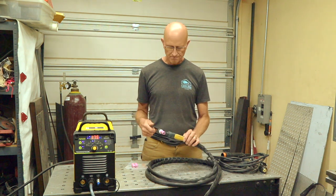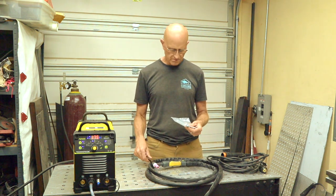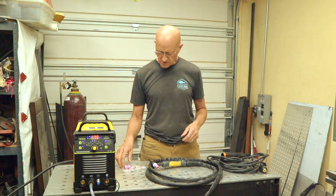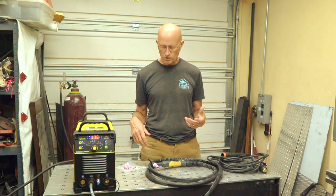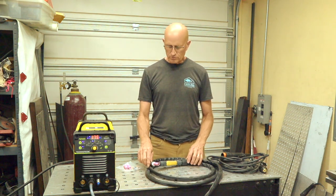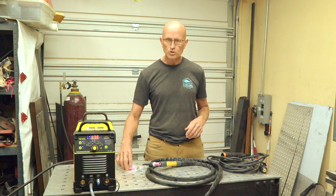It's perfect for 200 amps or less. It comes with a long handle, a short handle for tightening your tungsten, three or four collets, and three ceramic nozzles — basically enough to get you going. If you're going to do a lot of TIG welding I'd suggest buying more, and if you're welding aluminum, gas lens kits are kind of the standard now and definitely something I'd suggest. I did weld with the torch just as it came and it did great — you can definitely weld aluminum, stainless, or carbon steel with it.